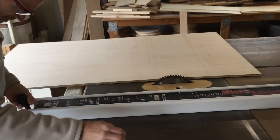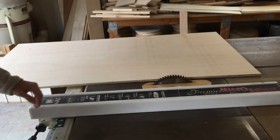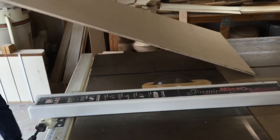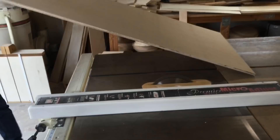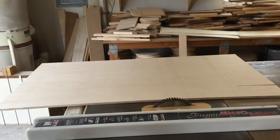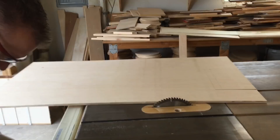Taking into consideration that my blade is a sixteenth of an inch. Now, the higher you can get your blade here the better, because it'll take less wood out of the corners. We'll do the same thing for this next cut, only we've got to measure over 20 inches and move the fence to 20 inches, then make that cut.